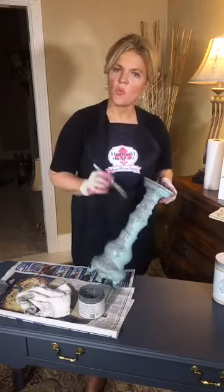You definitely want to be considerate of what you're painting over. I always remind people when you're going from a dark set of cabinets to white, it is very important. It's nothing to do with this paint product, but any paint product. If you're turning a cherry set of something or an old antique white, you definitely need to be aware of bleed through, and that's something that's noted in the paint world forever. So if you're a novice painter and you're taking something from a dark wood to a white, there are some prep steps that you need to be aware of, and that's shellac and so on. So not to get too in depth there, but just know, check it out beforehand. Even go on Google, research that a little bit before you start painting something dark to white.